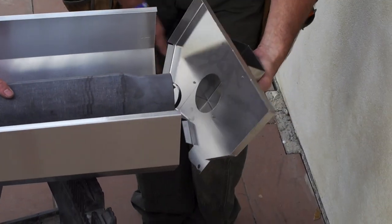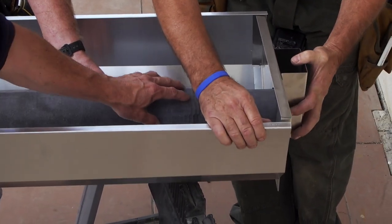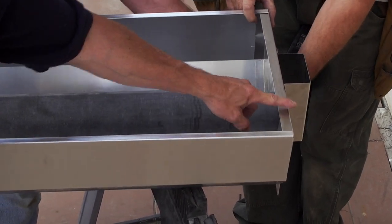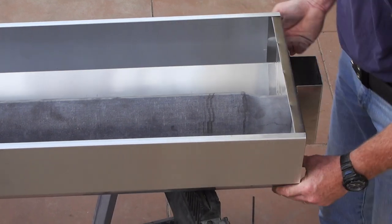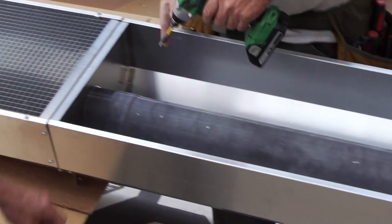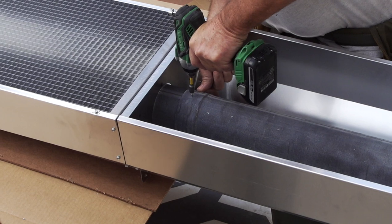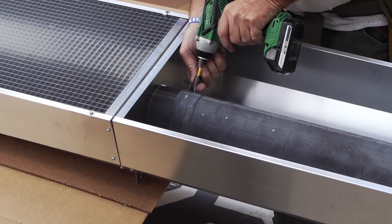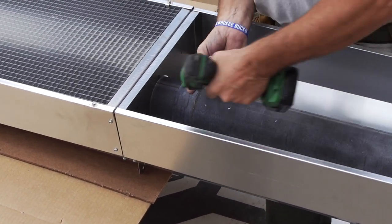Now we're going to be inserting our end plate. The end plate has tabs on it, just like we have tabs on the other end, and we want to insert the end of the pipe — it's got a reduction fitting here that slides into the cutout on our end plate. So we slide those in, seat it on the tabs, and make sure our pipe is inserted in the cutout. Now we have all the components positioned in the correct position, and it's time to screw down our auxiliary piece of pipe. We simply take some of the same sheet metal self-drilling screws and screw down through both pipes. We want to do at least three to four screws to make sure we've got a very tight connection that's not going to move while we're trying to install and lift the unit in the air.